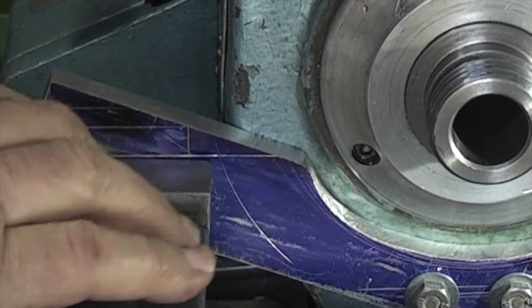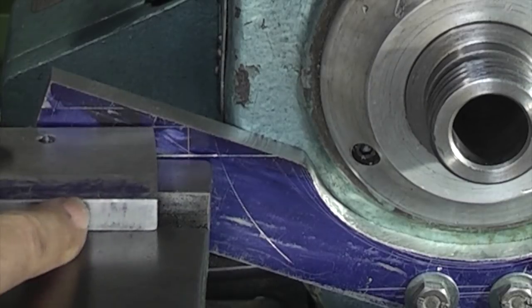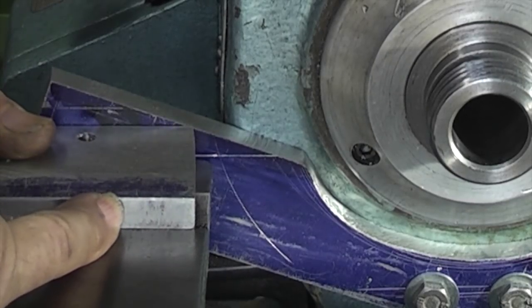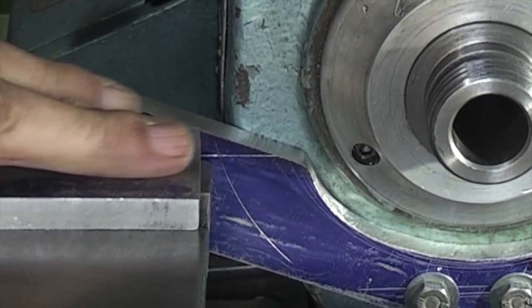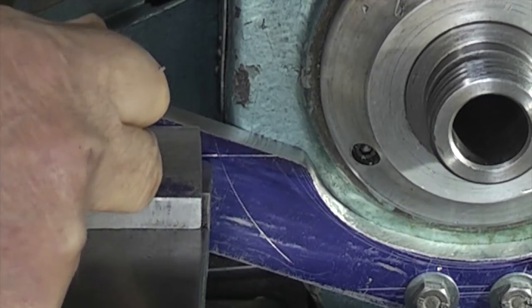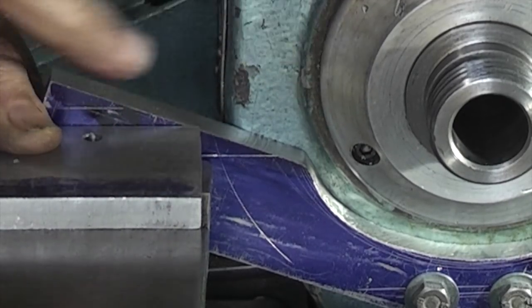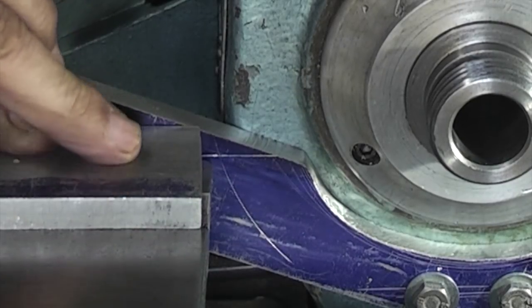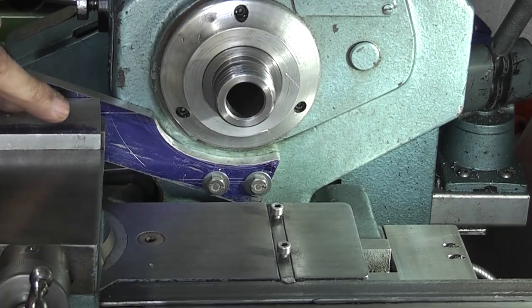And what I want to do is machine the groove in here, so I can slot a piece of 10mm aluminium plate in, and that will give me a platform for the indexing ring to work. And I'll machine a slot across here so I can move the indexing pin, which will fit into the holes, in and out. So when I have more rows of holes, I can move it to the next row.